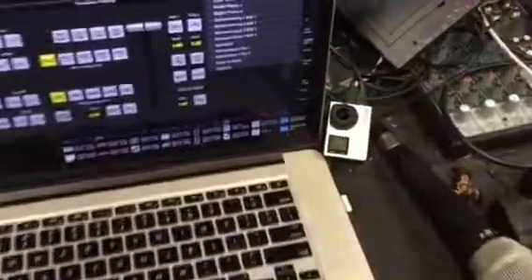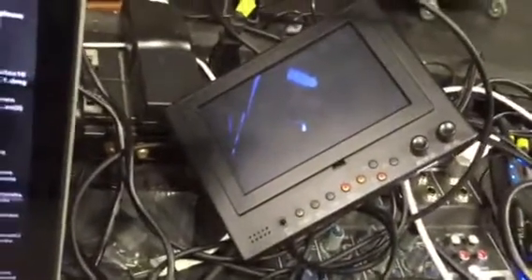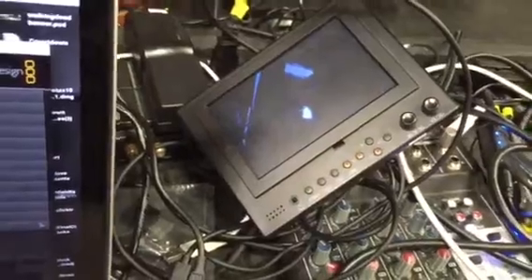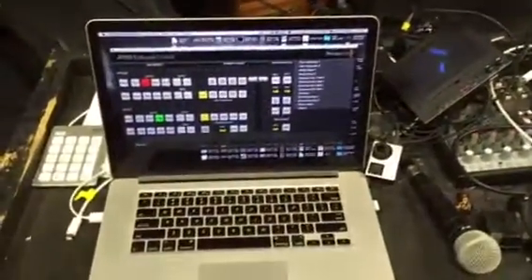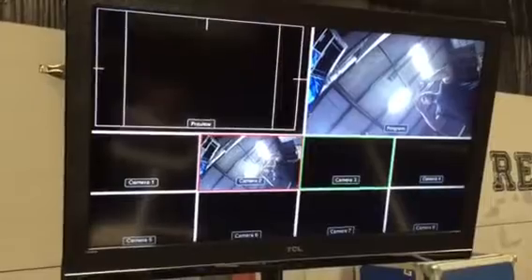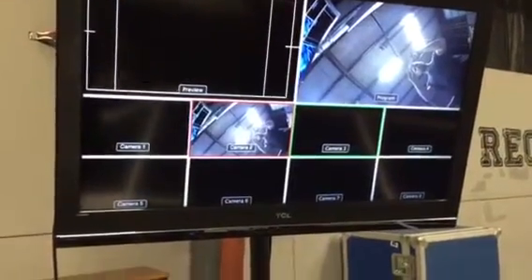How do you get a GoPro 4 Silver to work with an ATEM switcher? All I did was plug it into this DSLR monitor, which has an HDMI out. It changed it to 1080i automatically. Then the HDMI is going into the back of the switcher, and it is showing perfectly in 1080. I think it's set at 60 frames a second — I probably could change it and it may still work. I've not tried that yet.